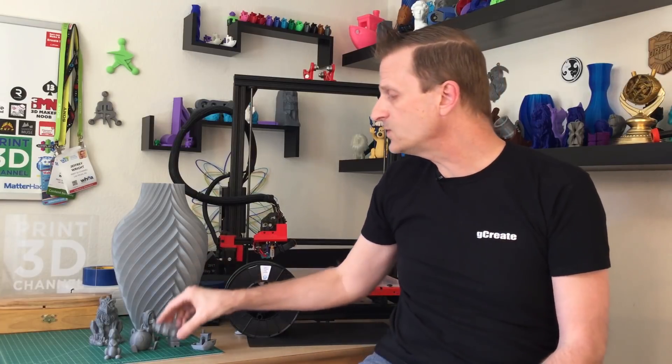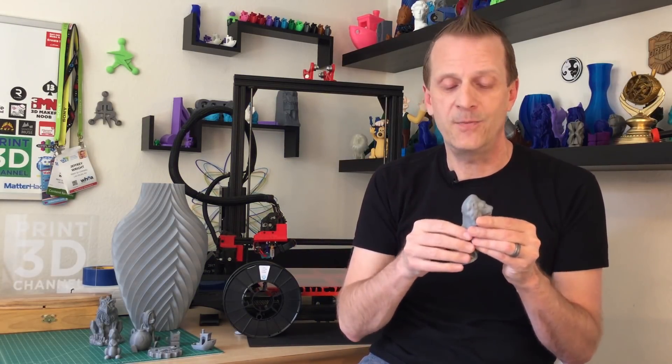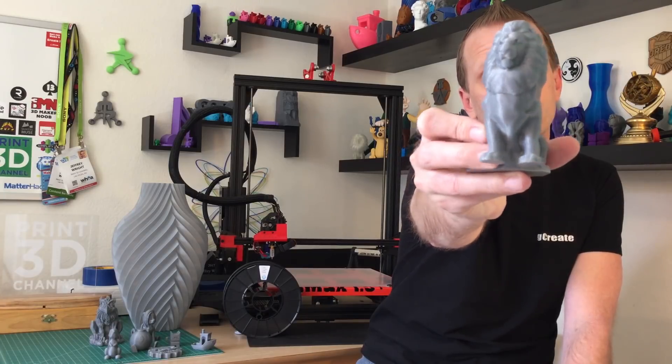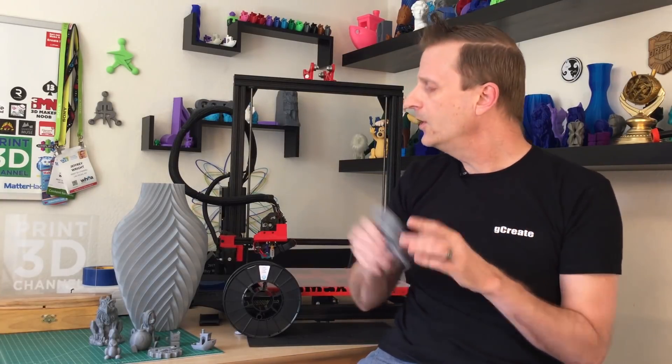It was time to print the Lion HD. This model gives me a chance to show off how well the glitter is distributed throughout the filament strands, because I use a 0.2 millimeter layer height. The Lion HD print turned out awesome with no problems — no retraction issues or anything else. There's a nice even distribution of the sparkle throughout. The sparkle type of filament is usually reserved for things like statues you might put on display. I think this is a really good medium level of glitter distribution — not overly intense, but very visible.